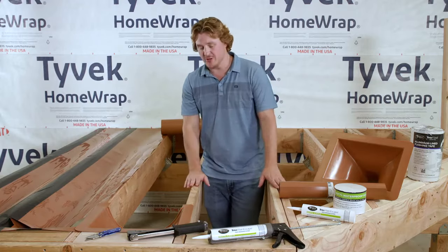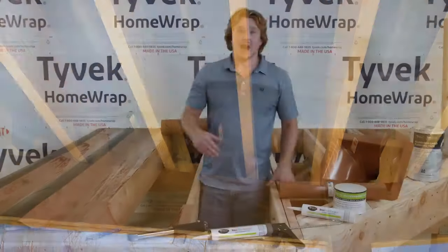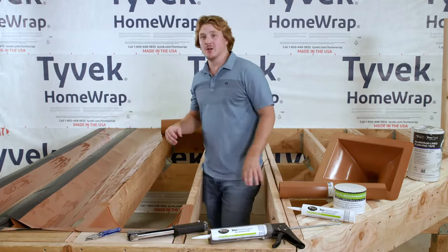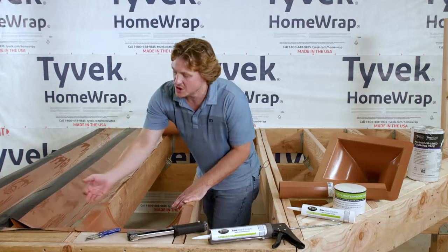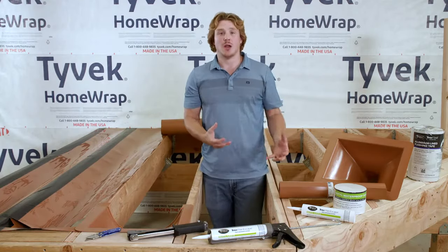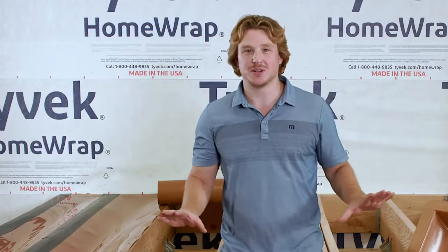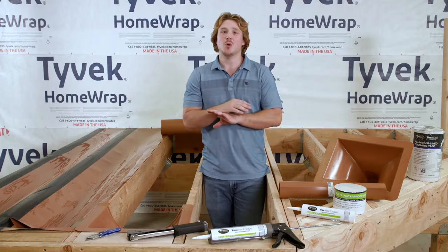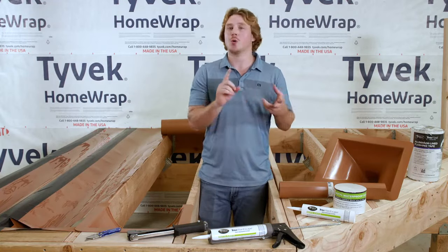To accomplish these things, you should consider installing an under-deck drainage system, which is best done when installing a new deck since the system is installed over the joists and under the deck boards. An over-the-joist deck drainage system, such as Trex Rain Escape, diverts water through drainage troughs and downspouts to a gutter system that then drains water runoff to the ground. It provides complete protection from the damage caused to the joists and other wood framing repeatedly getting wet. It covers and protects all the wood substructure and can be installed with any type of deck, whether you have composite or wood decking.